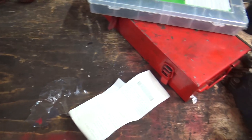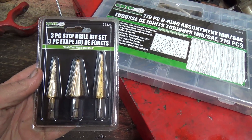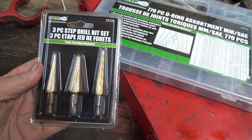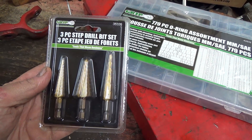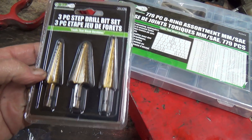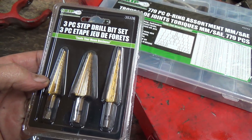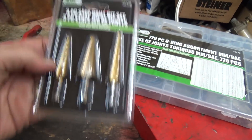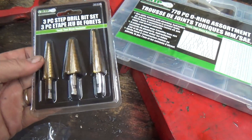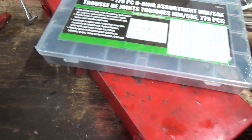The other thing I got here — I've got a set of these for when we work on this little fuel tank here for the Empire engine. Got it cleaned up and I'm going to probably sandblast the outside and leave it bare steel for now, because I want to put a drain on the bottom of the tank. I'm going to use one of these to drill down through to get the hole drilled in the tank and then solder on a nut that I got a drain for, so the drain will thread into it. Then we'll seal it with some thread sealer.